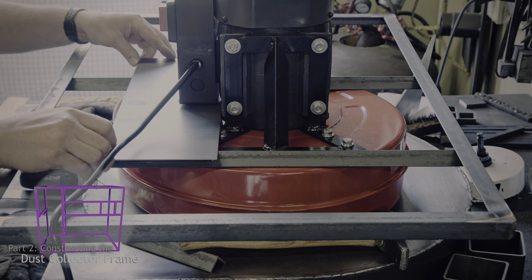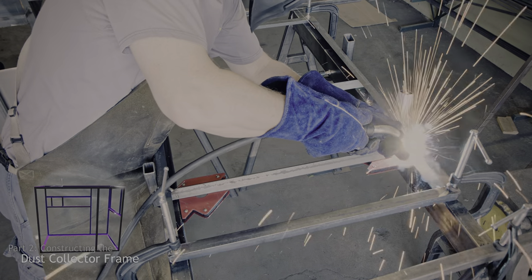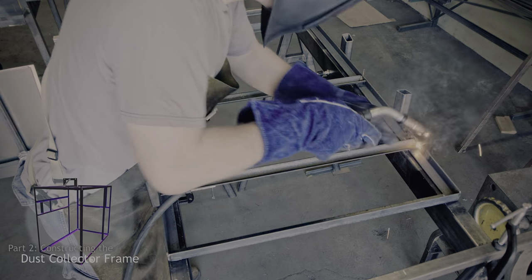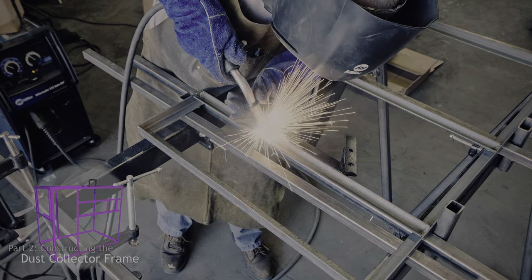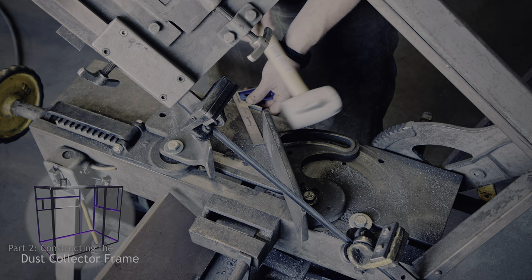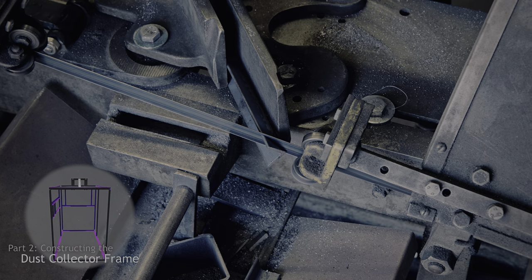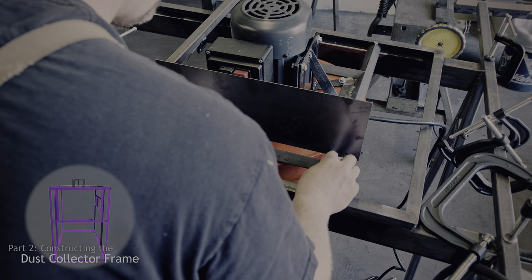Looks good. Now let's go back to the top frame and figure out a way to suspend the blower from the little frame you saw me make earlier. For this construction, I just end up using more angle iron as it is fairly rigid and still very easy to work with. Putting everything together is still a little bit difficult. Welding long seams has a tendency to warp the pieces due to the heat involved and clamping does not completely solve the problem. In this particular case, the frame lifted up a little bit and while the blower still fits, it is a little bit more difficult to attach than I would like. I need some more strength in the frame and will attach a couple more pieces of angle iron that can hold the frame for the blower in more places than just the one long seam I welded.